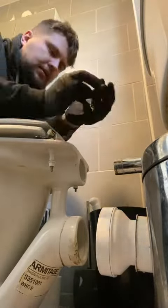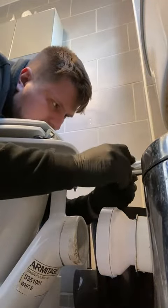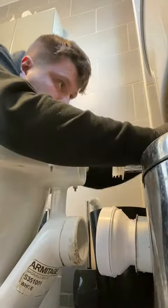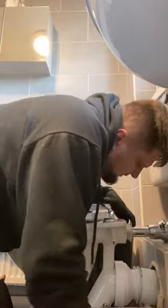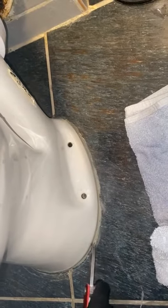Apart from the McAlpine pan connector, I've started using Viva for all the loose toilet bits — flush cone from Viva. I like the hard plastic ones; I know some people aren't a fan and prefer the soft rubber ones. Also using Viva for the pan fixings. We've wiggled the toilet back into place so we know exactly where it needs to be.